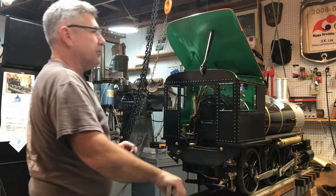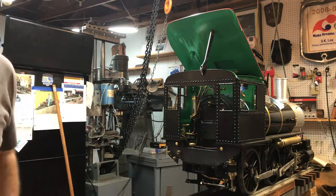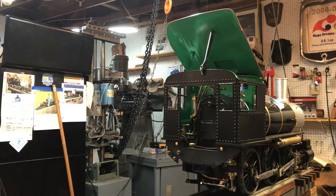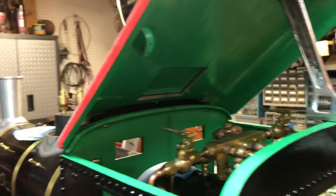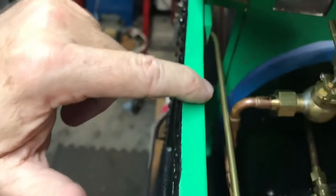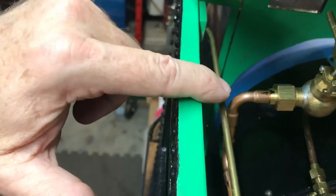So that's lined up — that's where it's gonna sit. I'll pick up the camera again. You can see my high-tech use of the crescent wrench there to hold the lid open, but I needed to do that. I was fiddling around. The reason for these elbows is I needed to run the ejector steam supply line so that it would clear the support prop rod.